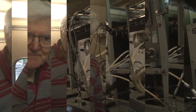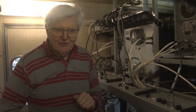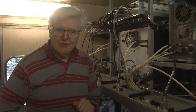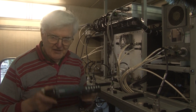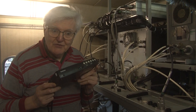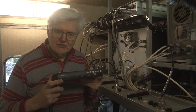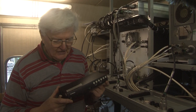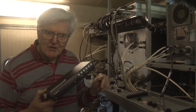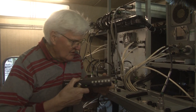And finally the main supply. We'll go around the front and turn it on. We've turned our check receiver on and we're back around. Unfortunately these days there are no analog television transmissions - there's only digital Freeview. So we have a solution: a converter box, or a bodge box if you like. This takes in Freeview and provides a modulated analog output, in this case on channel 52.